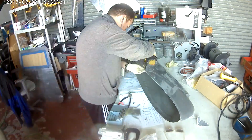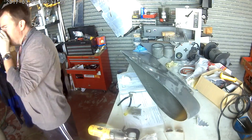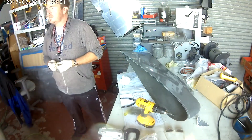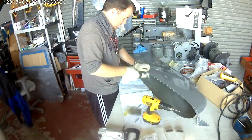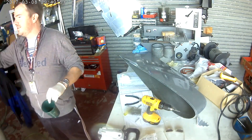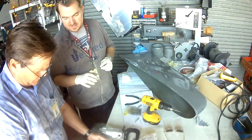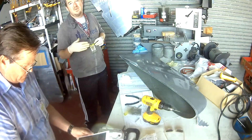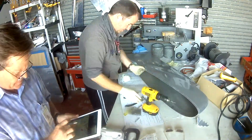Now that we've got that sorted out, I took the wing lens off because I don't want to damage it any more than I already have, and it's going to sit for a long time. So now we're putting on all of the nut plates. This is a very tedious thing — basically they're all number 40 holes drilled all the way around, those being the pilot holes from the wing skin into the wing tip. You then enlarge those to number 27 and use the nut plate rig. The number 6 screw holds the nut plate in place, you drill two number 40 holes lickety-split, move down, do that again, then go back and rivet everything in. And then you've got all these nut plates in.